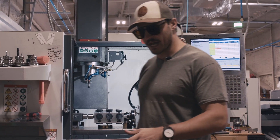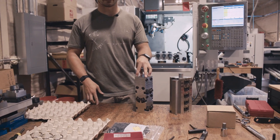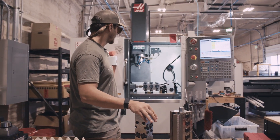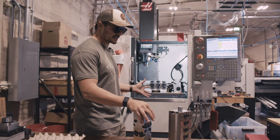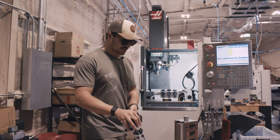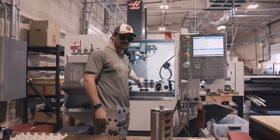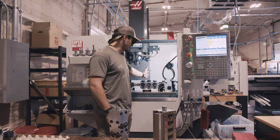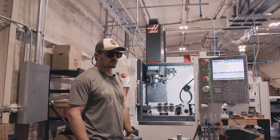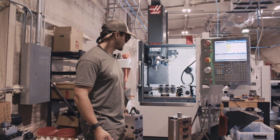Fancy tombstone systems will be palletized, so they will have studs, like we talk about in our 'What is a Pallet' video, that you can quickly swap these in and out. Our system is a little bit different than that, but each of these is a different tombstone made for different parts. The tombstone in the machine is made specifically to hold 12 pieces of two-inch round material. They can be different heights and different materials. We do our Delrin inserts with this tombstone, and we prep our two-inch stock for case backs and bezels on that tombstone as well.